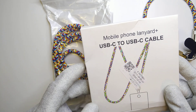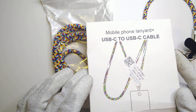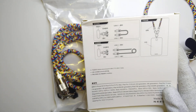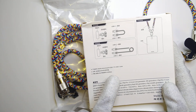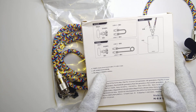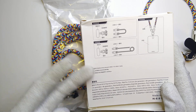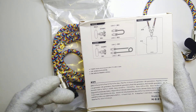The shorter one features a nice box, and you can see they did invest some money into having that manufactured. Looking at the specs on the box — it's a 60-watt cable. Unfortunately I don't speak Chinese, but I can read the 60 watts and that it's a USB 2 cable with 480 megabits per second data transmission speed. So it's pretty much a bog-standard cheap USB-C to USB-C cable with the minimum requirements for charging and transmitting data.